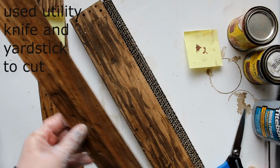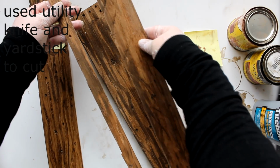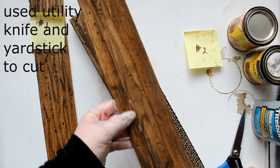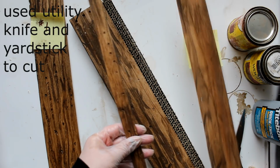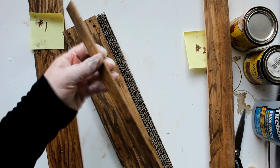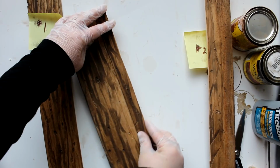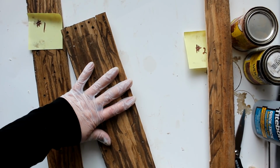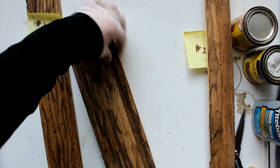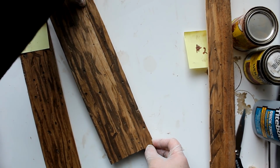And now here you can see how I cut the second board all the way down the full length of the board, just having the skinny piece that's going to fill in the back portion of the shelves, both top and bottom. But I will now just lay that in. I'm going to put that on the side that has the machine cut, so I don't have any gapping. So it's machine cut to machine cut. And then I'll cut it off there at the bottom for the length.